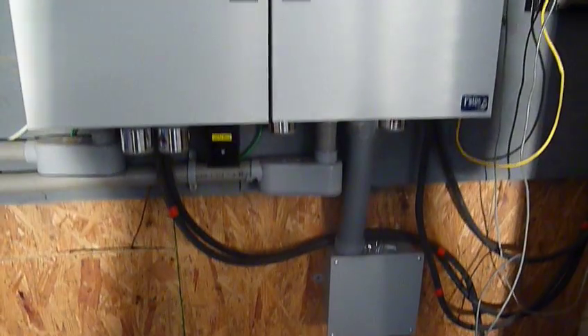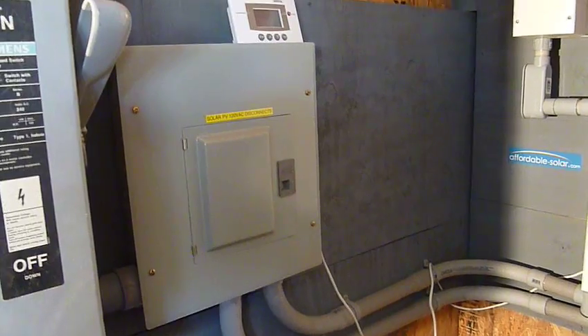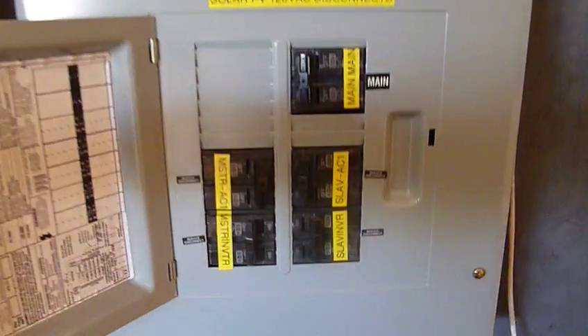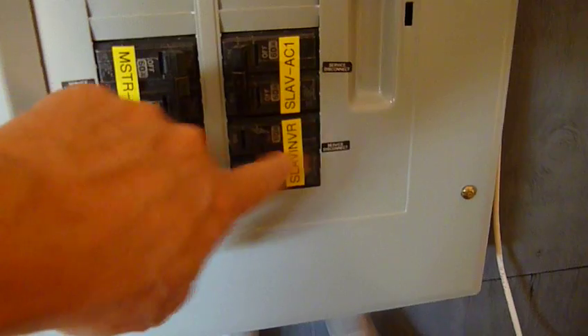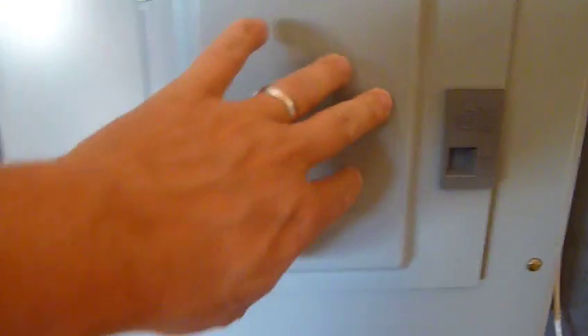Cleaned up all my cabling and rerouted all my electric. My main panel was originally feeding in from the inverters over to my main breakers for the house, but now I've created my own complete sub-panel for the system. I've got a main disconnect for the entire system, and then both inverters on A and B side. I can control each one independently, and they go into my big 400 amp knife switch which feeds everything.